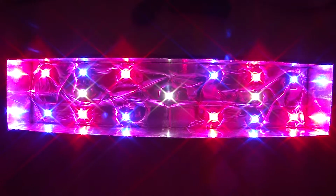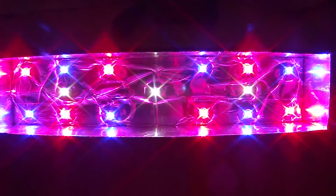And even within that, we keep trying Sun Pulse. We try GE ceramic. We try Sylvania ceramic. We've tried other brands of ceramic, and it ultimately comes back to the Philips right now. And within that, soon you're going to see higher efficiency ceramic metal halides with the same spectrum of the Philips 4000 Kelvin that we're seeing in the horticulture world. So instead of looking for a 600 watt ceramic metal halide, you're going to be looking for a 300 watt or 280 watt ceramic metal halide that's going to be putting out essentially 500 watts worth of current power. So that's where we really see it.